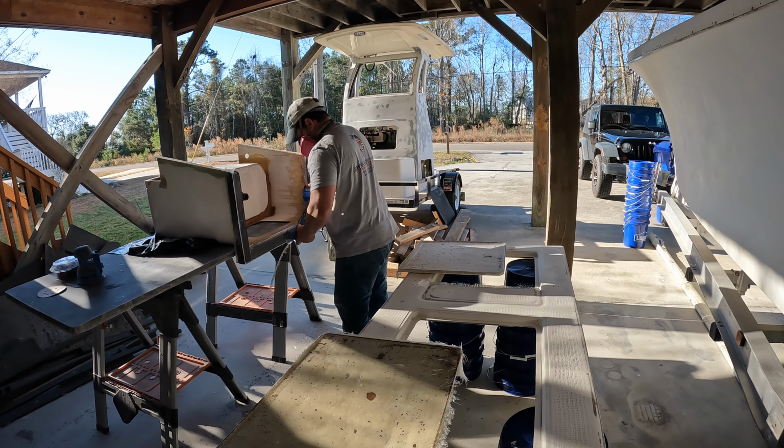This one probably looks a little bit better because I was able to get in here and reach a little bit more with the grinder. There's a 1/4 inch lip right here, so I can slide my through hole in my cap over that, and then 4200 it in, and it'll drain water way better than what it did before. Also, all this is glassed in, to glass the hole back down to the stringers, so that looks really good. I'm really happy the way that turned out.